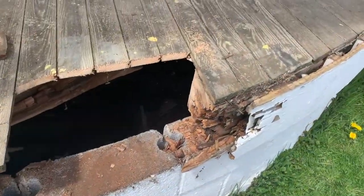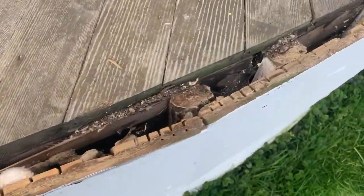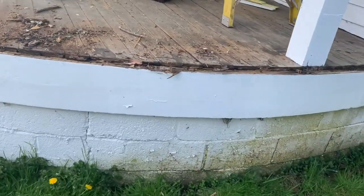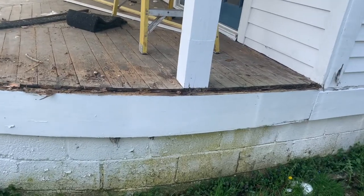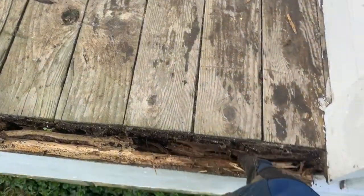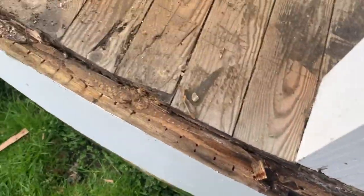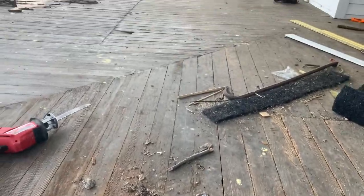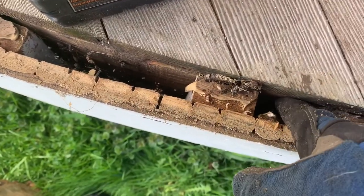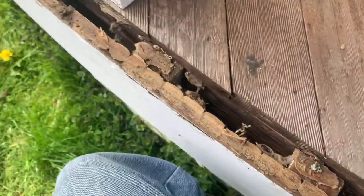Update on removal of the outer band — it was pretty cool to note how they got this round one-by. They notched the back of it and bent it in to meet the contour of that round shape. You can see how bad it's rotted — I can stick my finger right through all that material, it's just dust now. They have a one-by here that goes against that beam, and this outer band where they cut a notch so they could bend it around the perimeter of the radius of this porch.